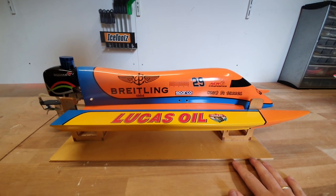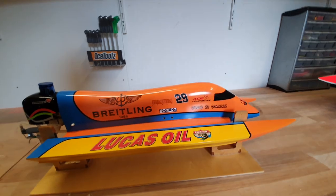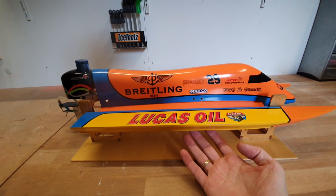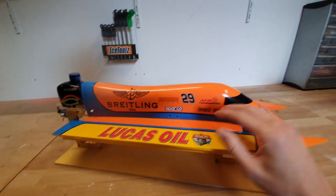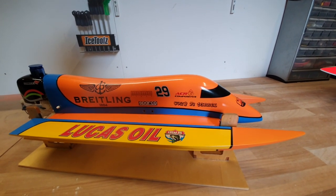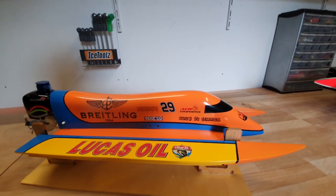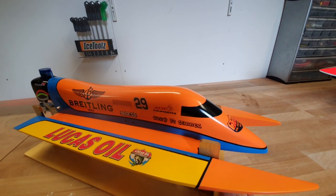It is made from wood. The framing is all done by wooden ribs, and it's covered by birch ply sheets — a 1 mm birch ply sheet for the bottom and 0.8 mm birch for the top parts. The hatch is made from glass fiber; I made it on top of a mold, and after releasing from the mold I cut it into shape. I'm quite happy with the result.